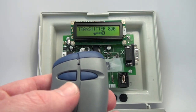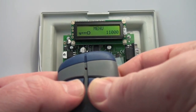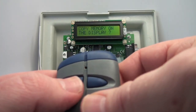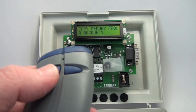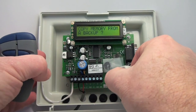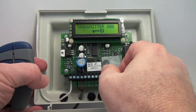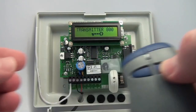I was going to show you how to do a restore off the memory chip, so let me do that quickly before we end. Go into Copy Memory. The next option is Copy Memory from a Backup. You simply insert the pins in — you can do this hot, it is not a problem, but it takes you back to the main menu. Push the backup drive pins in all the way.